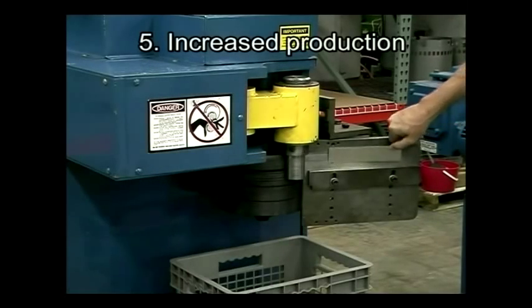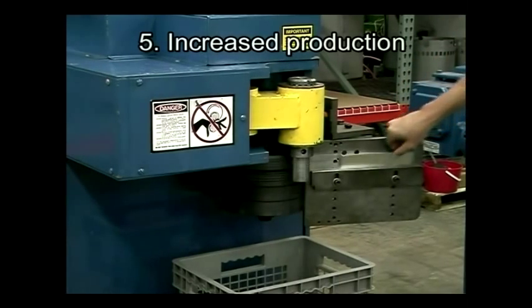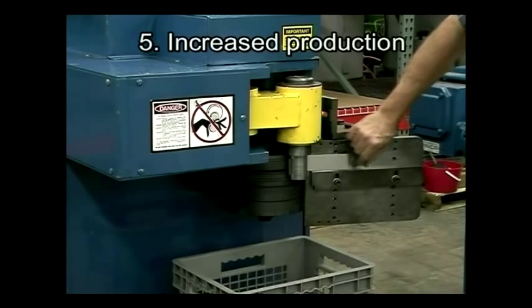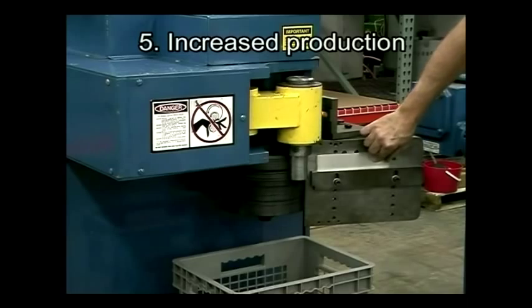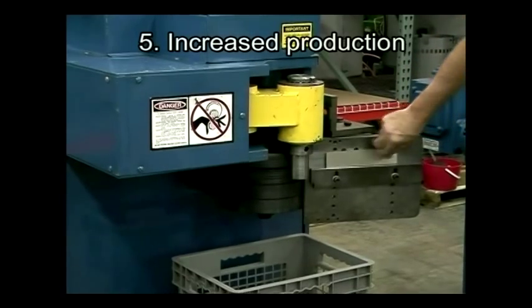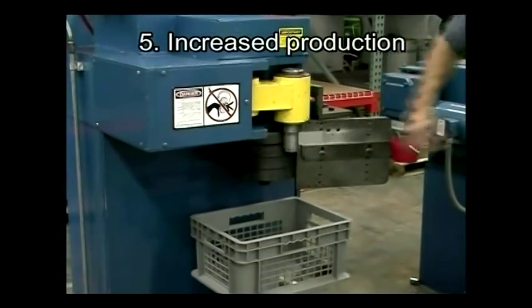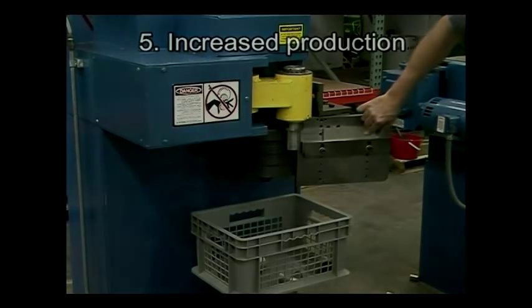Acrotech's one-pass two-roll bending machines, as the name indicates, produce parts in a single cycle. Pinch or pyramid machines generally require several cycles or passes prior to achieving the needed shapes or sizes. Hourly volumes of 100 to 350 parts can be achieved using our standard machines, with up to 1,200 parts per hour possible with customized machines.